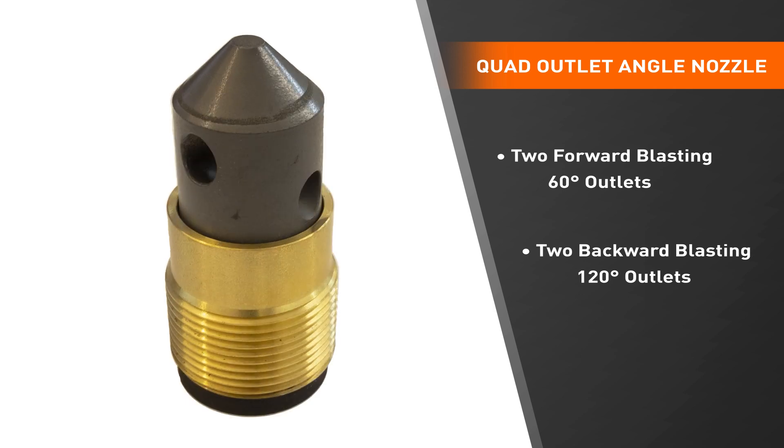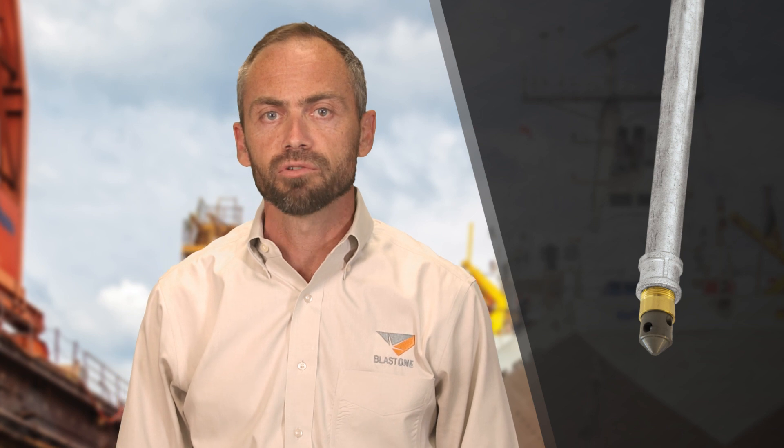This is a great nozzle for hard to negotiate tight spaces. The next question is: how do you feed this nozzle into the chamber to cover the 12-foot depth? Our client actually fitted a similar nozzle to a steel pipe, creating in effect a multi-foot long nozzle that was then attached to a one-inch blast hose. This gave them the control and rigidity needed to maneuver between the channels as well as get the underside of the pipe.